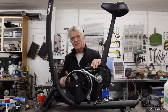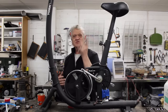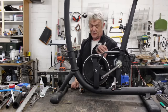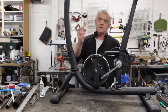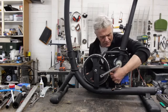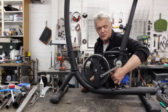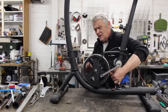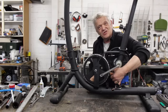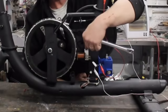I'm going to put magnets around the rim and use this as my rotor, so I'm just going to stick a whole load of magnets on there. There we go — magnets glued around the flywheel. Now I've got this, which is the fan of a microwave oven. If I pull that bit out I get a coil with a core, and all I'm going to do is stick that right there — and that will be my generator. You could put loads of coils all the way around it if you wanted, but I'm going for the easiest, simplest option: just stick a coil right there. There's my coil, glued in place.